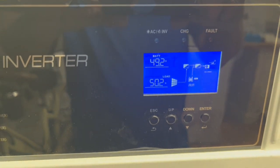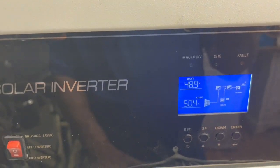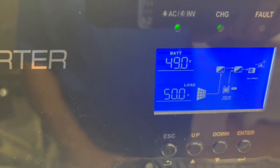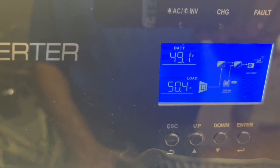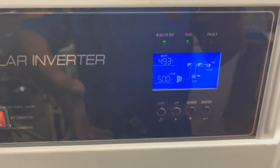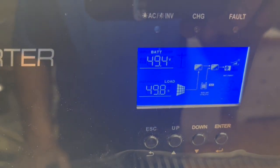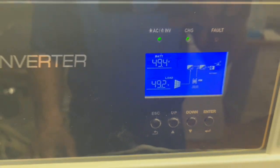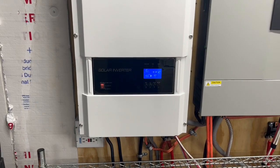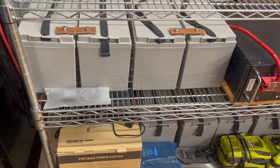So that's pretty close to it. If I added another 18 to 20 panels — for a total of 60 — I should be able to keep this fully charged up around 54 to 56 volts. And if I were to turn one of these off, it would go right up to 56, 57. With just 42 panels on here, we're able to run that, off of those AGMs across the two battery banks.